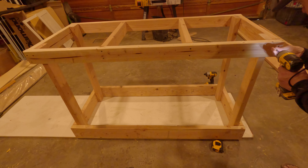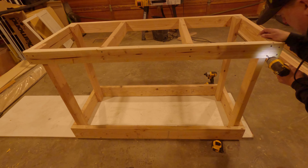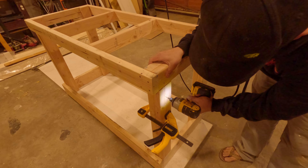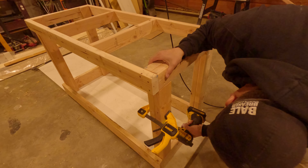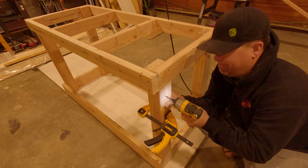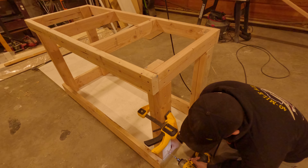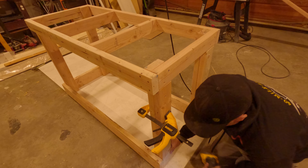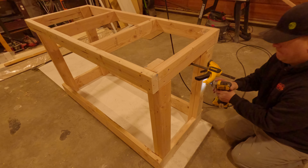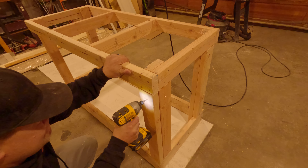In this situation, I'm going to have a huge tank on top of this quartz piece, so I wanted to have extra bracing and make sure there was no wiggle at all. Everything had to be perfectly flat on top so that there was no high spot for the quartz to crack. These pieces I'm attaching now are additional support for that 2x4 top, and they'll carry the load down to the 2x6 below. A little overkill, I'm sure some people will say, but in Alaska we get a ton of earthquakes, so I just want to make sure everything is solid.